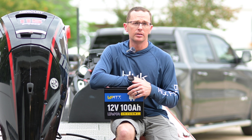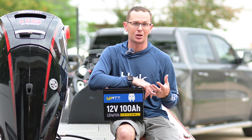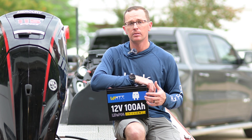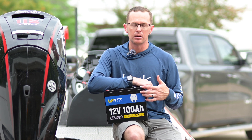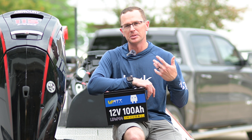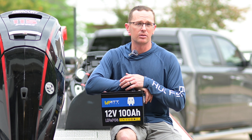When it comes to charging this battery, it will technically take 100 amps of charging, but good luck finding a charger to do that. The rated charge rate is about 0.2C, so 20 amps would be a typical target range. You can go down from there if you need something more cost-conscious — 15 amps, 10 amps. I'd really not want to go less than 5 amps just for the duration of charge.